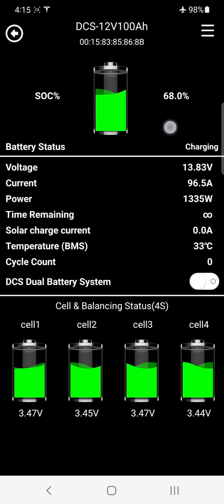You can see the state of charge coming up in one percent increments. Cycle count: once you fully drain and fully charge the battery, that's one cycle. So if you do 50% depth-of-discharge cycles, it takes two of those to equal one cycle — two times 50 is 100 — and that cycle count dynamically increments over time.